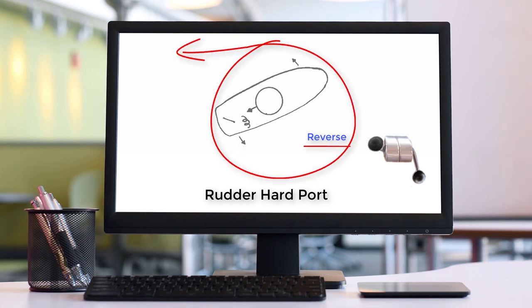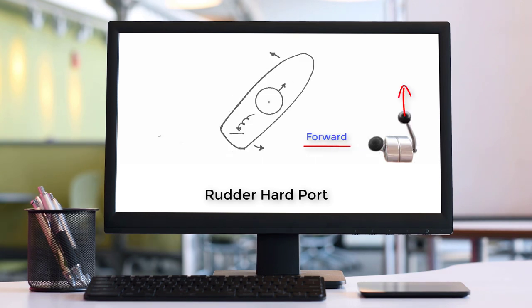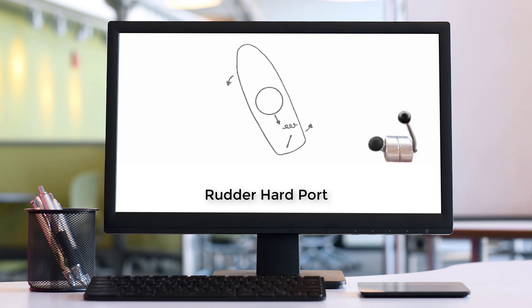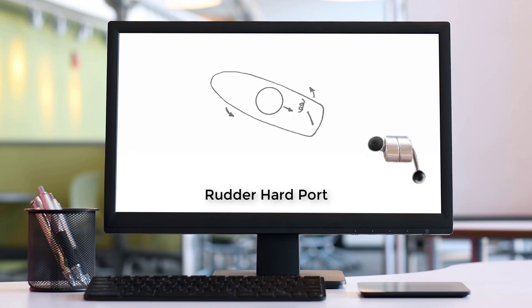This will be especially effective since the boat is already rotating counterclockwise. Again, we shift back into neutral before the boat gets any way on in reverse. We go back into forward for a second or two — prop wash pushes the stern to starboard, accentuating the rotation already taking place. We shift back to neutral before the boat gains any forward momentum, and we repeat this sequence until the boat has rotated all the way around or to whatever degree we want.